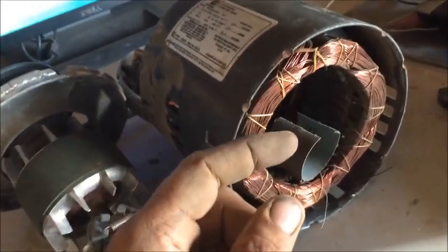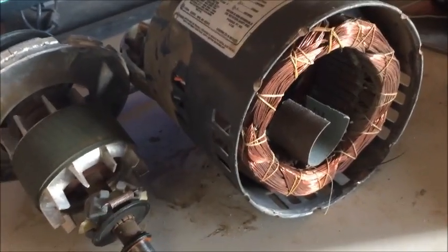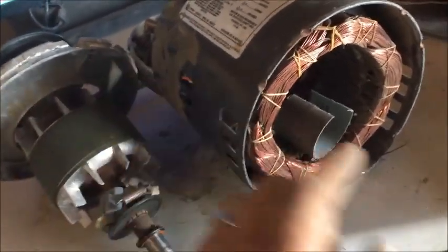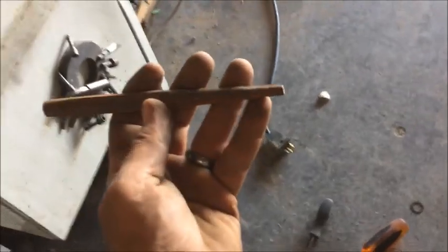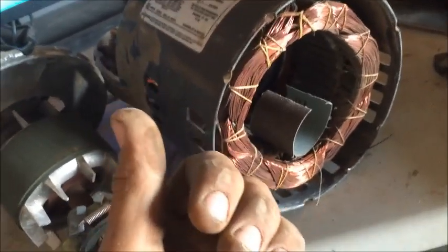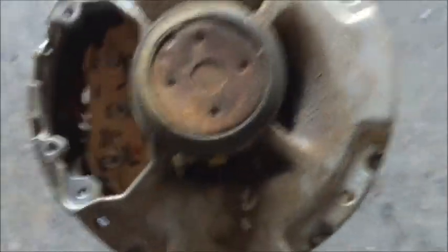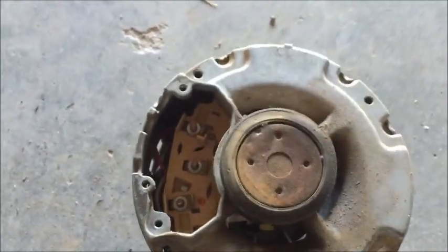I'm going to jump back into the video where I've been oiling. When you put it back together, just tap it back together until it's flat and knock all these beads down just a little bit. Use a punch like this or a big screwdriver and just knock them down — it'll hold the case back together, it doesn't take much. Line up each one and smack it hard all the way around, just give it nice little taps until it goes back down, then tap these back down.